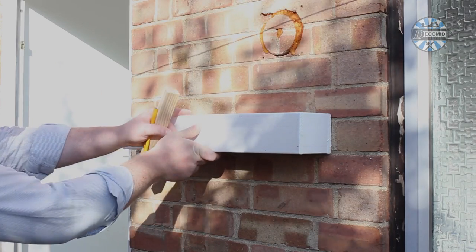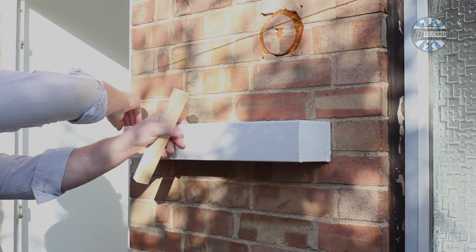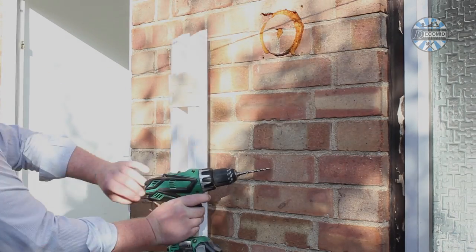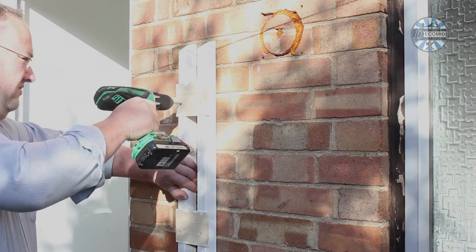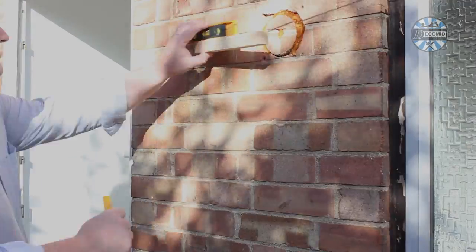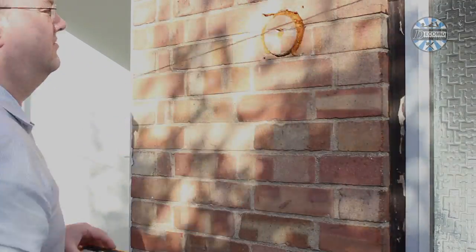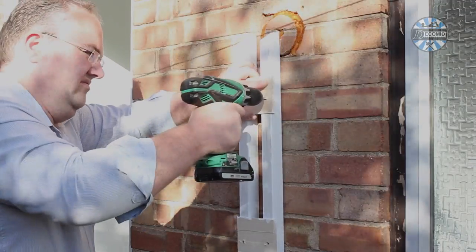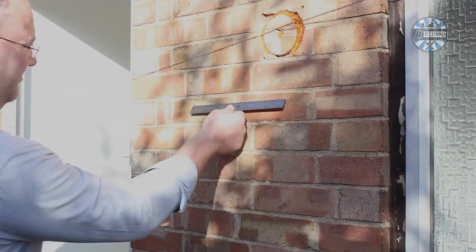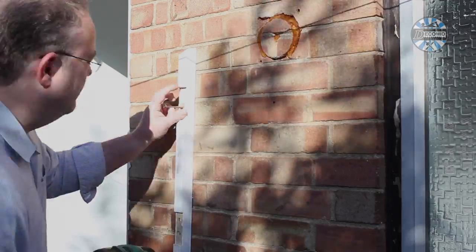Having measured these to fit, I wanted the trays to sit evenly in the gap. A quick offer-up allowed me to mark where the battens needed to go. Using an easy reference point the drill holes can be started using the battens as templates. It was clear the straight line wasn't straight and I needed to improvise to make this work. A quick check indicated it all looked good at this stage. Pop in some rawl plugs and then fit the battens.